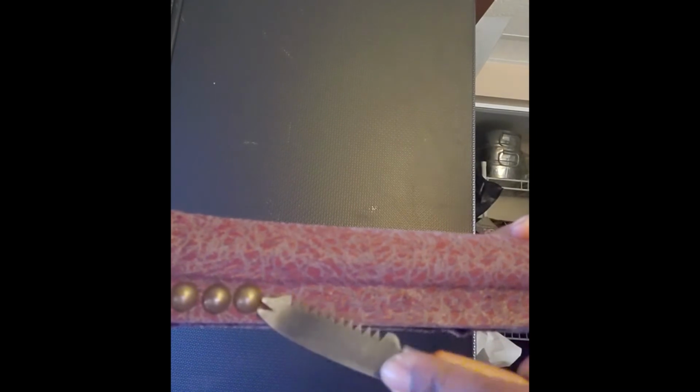So in this situation, I get up under the tack, and then I use the frame to push it out. And sometimes I put my finger in front of the tack so that it won't go flying out in my face or anything. The final piece I like to use is this upholstery staple remover.